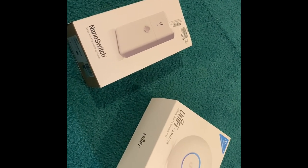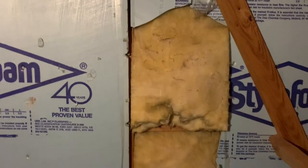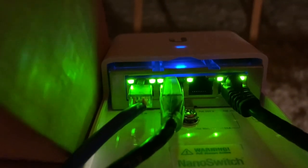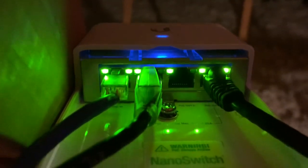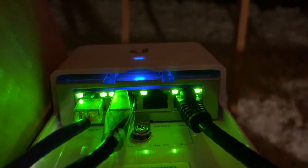Here's the access point we just put up in the attic - it's right above the living room, so it's going to give enough coverage downstairs. The two cameras on the outside of the house are the Ring cameras, and it's going to provide power through the wall on the other side of the third level of the house. The Ubiquiti Nano switch here has the uplink on port one. The second port - you can see the POE light on the left is on, however the right light, the data link light, is off.